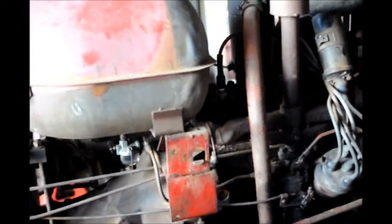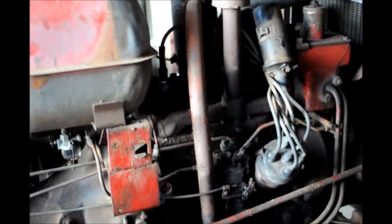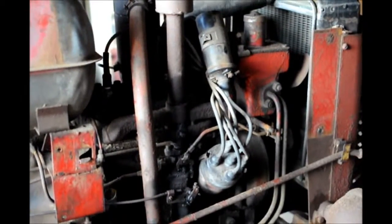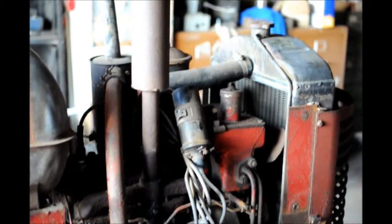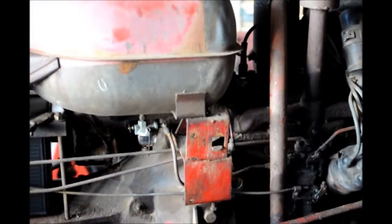They got the little Pony started today. They had a series of little setbacks, but got it now. There was a gasket leaking around the little sediment bowl. Michael, the owner of this tractor, went and made one out of a piece of rubber — that's part of this job, do what you can.